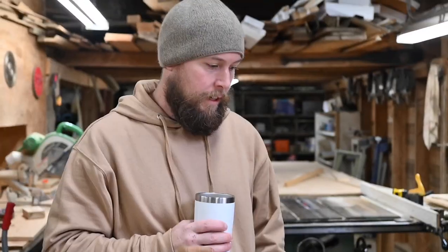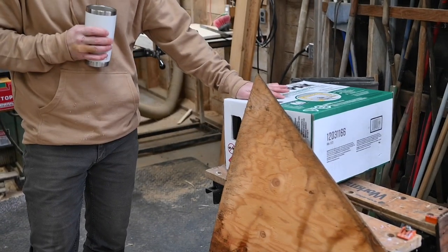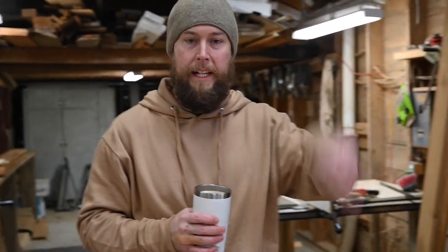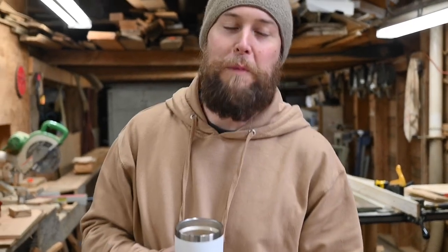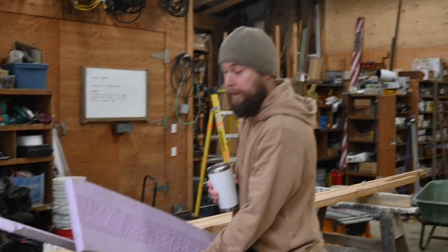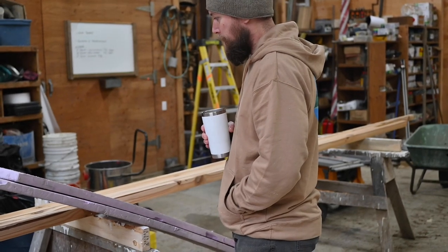I am making an insulated box that will go around the spray foam box with enough room left in between the insulation and the box to put a heated blanket so we can keep the spray foam above 24 degrees. Perfect. Celsius. So I have cut, I've ripped this styrofoam in half because it was too thick. So that should be good for that.